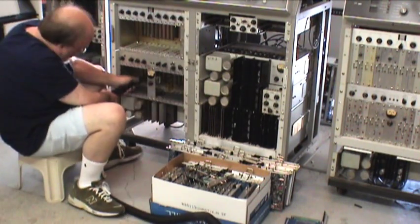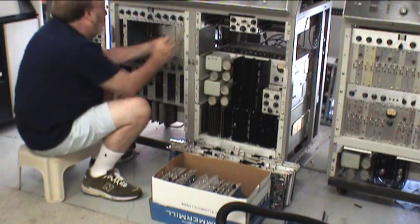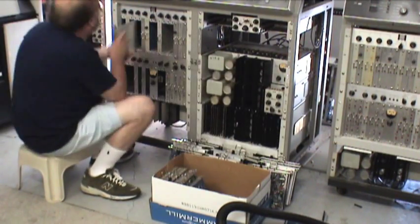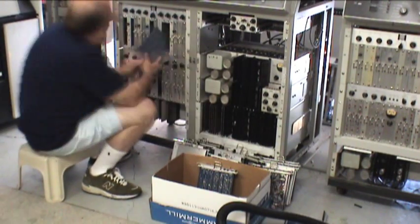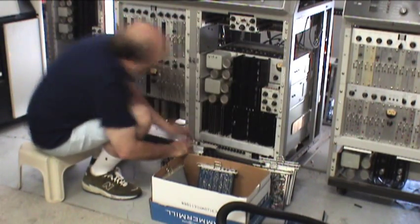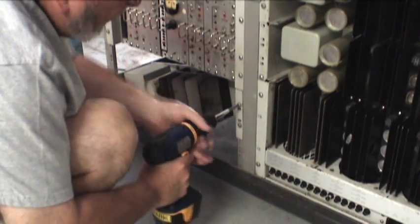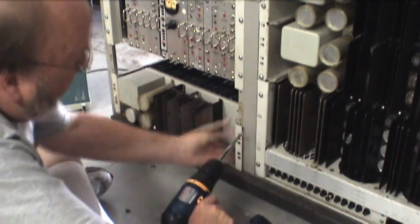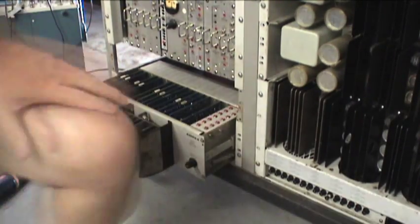Now let's load up the machine. The top portion of the cage is the signal system; the bottom portion is the servo system. Making sure that the right cards go in the right position in the right part of the cage. Don Norwood had a great suggestion — he said to take the VELCOMP and move it down so that it's the first part of the machine, and then put the fan in between the VELCOMP and the servo system. That makes cooling of the servo system better because the VELCOMP doesn't block the airflow. That was a good idea.